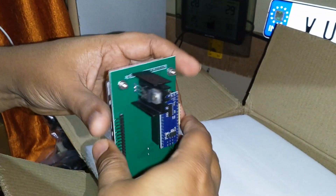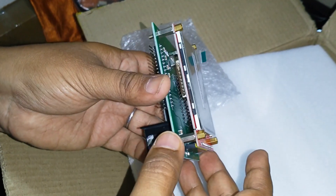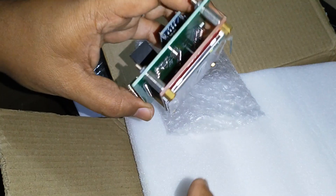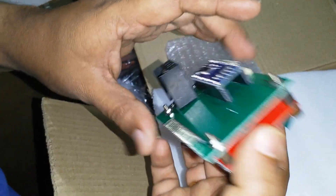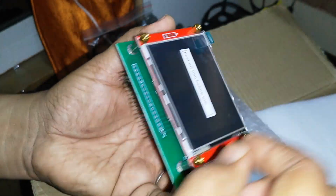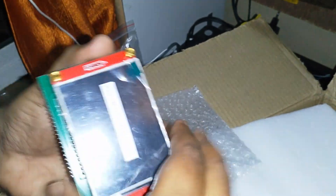On the uBITX GitHub there's original code available as both an .ino file and a hex file that can be uploaded directly. This display takes an SD card, presumably for ROM storage — that's good. It's also got a crystal. This flex connector goes into the display, and this looks like a 7805, a 5-volt power supply for the display. I'll assemble it first before peeling the protective film.